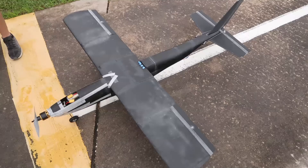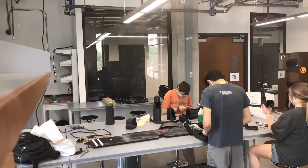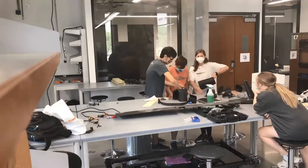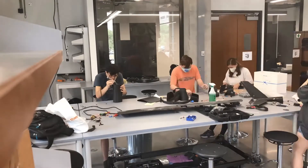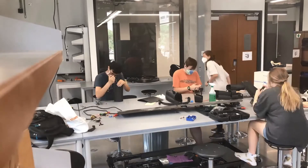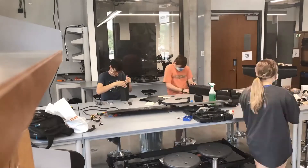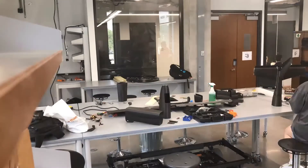The Penguin aircraft was a 3D printed aircraft made out of nylon 12 carbon fiber filament. The aircraft was 3D printed this year because of UT's restrictions on undergrad access to the lab, which made the team unable to get into any lab space to work hands-on with the aircraft for the entire fall semester plus spring semester until late March, early April. You can see here one of our work days of us assembling the aircraft. The aircraft takes roughly 30 hours to print all the pieces, including horizontal and vertical stabilizers, the wing, all the fuselage sections, landing gear, and other miscellaneous components needed for the internals. It takes roughly five to nine hours of assembly to completely assemble and wire the aircraft to make it flyable.